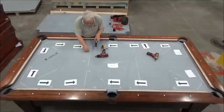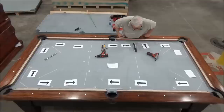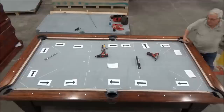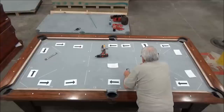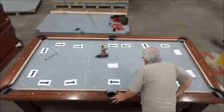And this one is about 4 thousandths low this way, just low towards that way. And this side, almost 6 thousandths low that way. And we'll see what it looks like across the middle there. And it's between 2 and 3 thousandths low towards the camera. So I'll say 3. And this one's actually 1 thousandth low this way.